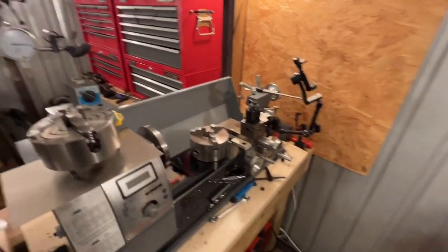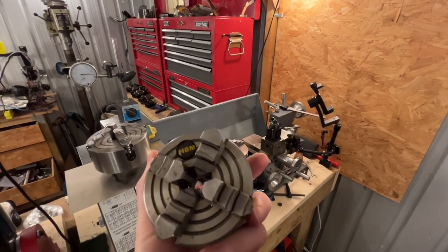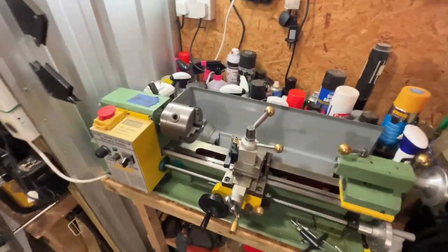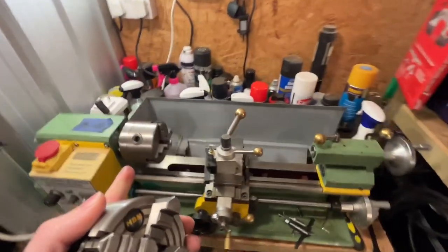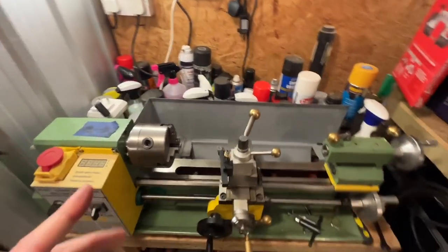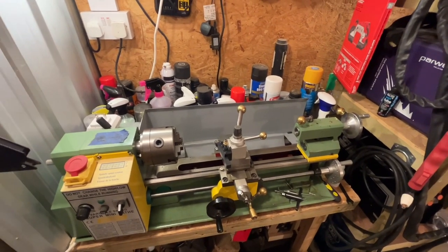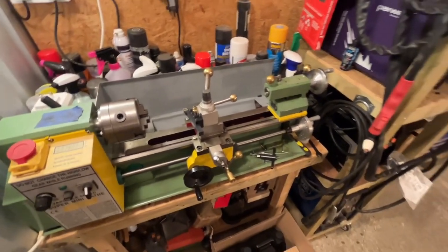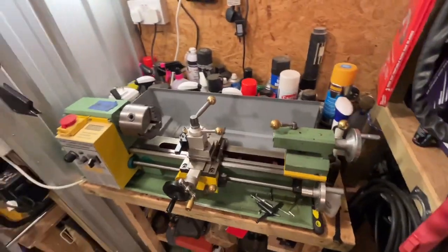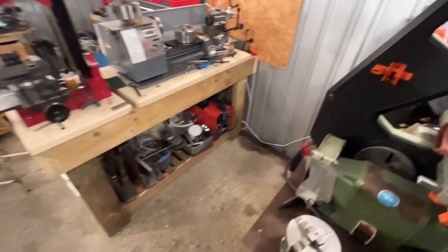I've been using this little 70mm chuck which originally came off my mini lathe, which I don't very often use on there anymore because the three-jaw 100mm chuck that I got on there I've set up perfectly — it's got like zero runout on it. So I pretty much leave that chuck on there and do all my real fine work on it.